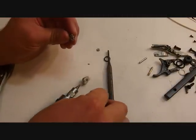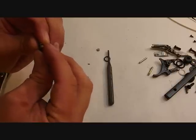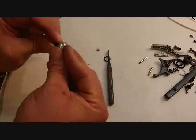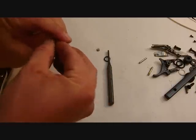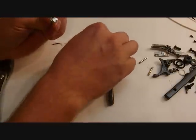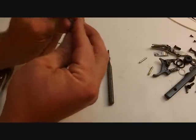The exhaust valve is comprised of the valve and rod, the body, a spring, a plastic washer, a small O-ring, and the metal clip. The spring goes on the rod, followed by the plastic washer and then a small O-ring. You then stick this through the body and hold it in place by the clip.